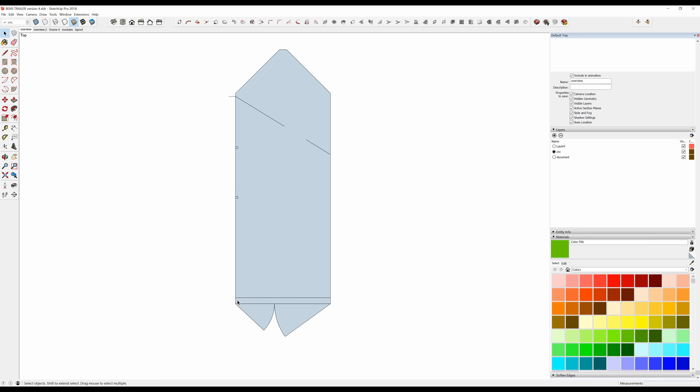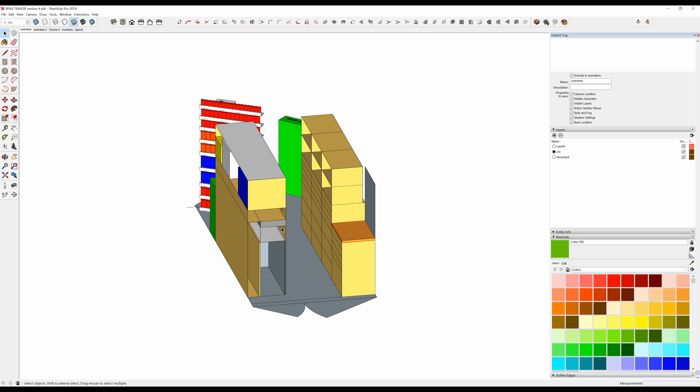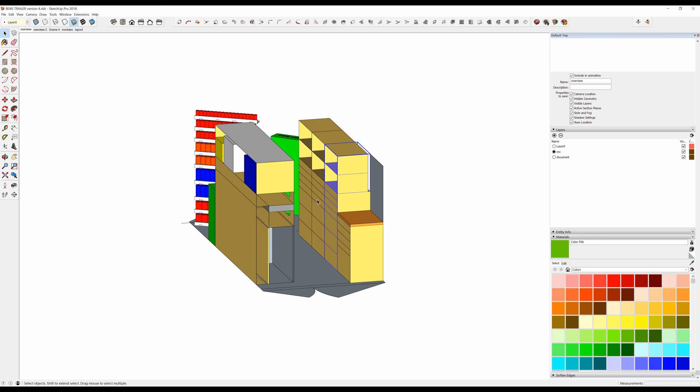We've designated this area in front — you see this horizontal bar — as a do-not-add area because he wants to put ladders in the backside here, possibly. So the design canvas is all of this space in here. We took these measurements one morning — he pulled into my driveway and five hours later we ended up with this wireframe model. We had the trailer to work with for dimensioning, and a whole list of notes for his specific tools and specific needs. You'll notice this design is just the wireframe — there's no thickness to any of this. When working out a design with somebody else, there's no need to get specific with joinery and all the little details. All we need is the major dimensions and make sure that stuff fits, and for that all we need is a wireframe model.